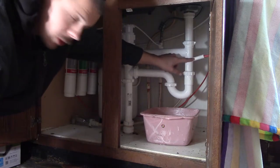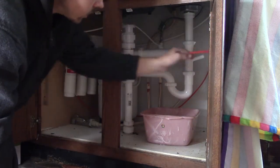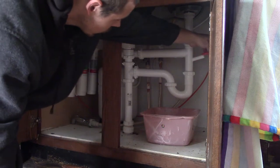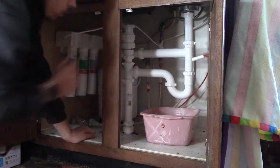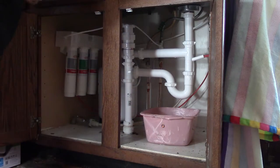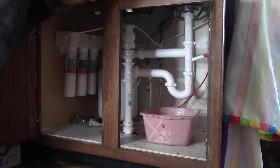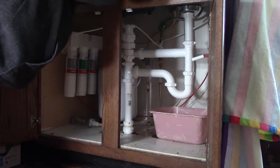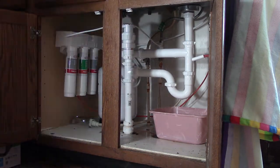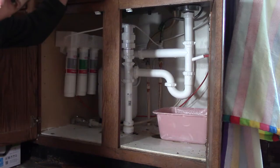This little side chute piece is actually for a built-in dishwasher. What I'm using it for is my water filtration outline, that I'm actually gonna have to buy a chunk of half inch hose for and run it up a little higher, because right now, if I turn the water on in the sink, ignore the drip, that has nothing to do with this. Oh, come on, now it's not gonna happen. There we go. Water escapes out through there. Which, obviously, is not a good thing. You don't really want water puddling in your cabinet.